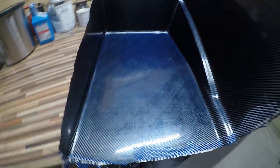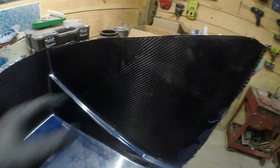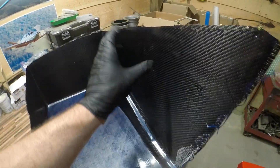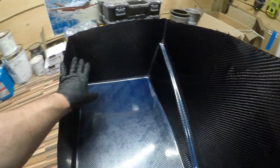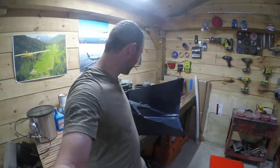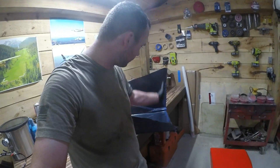Let's see what we got. We've got the 45-degree streaks from the release agent — that'll buff right out. I've got some minor defects in the cloth, no big deal. The Kevlar cloth that I got on here is really difficult to work with, and of course it's in the one spot that's going to be above the seat. This is three layers — I was going to do two, but I did three. I think I could go two on the sides and then three or four on the bottom depending on where the structure is. All the corners look really good. I would say that is an overall success. I've got some dry spots here that didn't get wetted out in the infusion — I cut it off maybe a little bit too early, but those will get trimmed off.